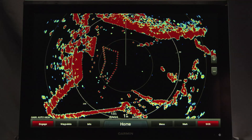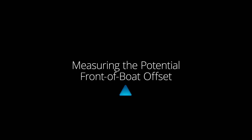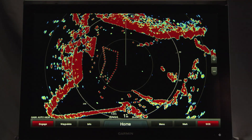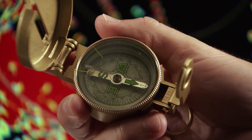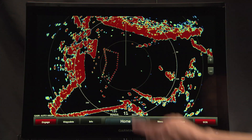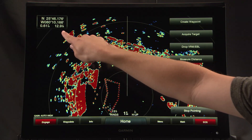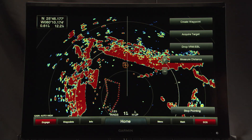The front of boat offset compensates for the physical orientation of the radar scanner on a boat, if the radar scanner does not align with the bow-stern axis. We'll need to measure the potential front of boat offset. To do that, we'll use a magnetic compass to take an optical bearing of a stationary target located within viewable range. Then we'll measure the target bearing on the radar and compare the two. If the bearing deviation is more than plus or minus one degree, you need to set the front of boat offset.